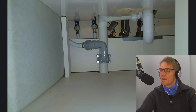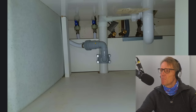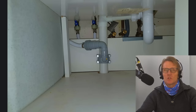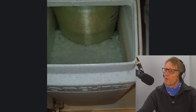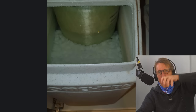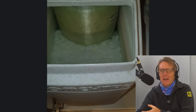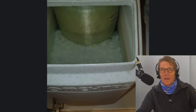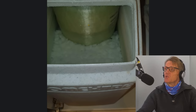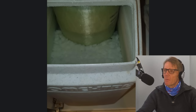What I've found about these spigots is that on some modern washing machines they set up a fault code because the drain is restricted - it's quite a restricted outlet for the hose just at that point where it drills into the pipe. Now here's the softener - this is the salt you put into it to regenerate the water softener. That salt isn't actually going into your water directly. What it does is backwash the resin in the vessel with a brine solution, and that regenerates the water softener. You do get a certain amount of salt coming through when it starts working again, which is why you don't drink the water softener water - we have a separate tap bypassing the water softener for drinking.